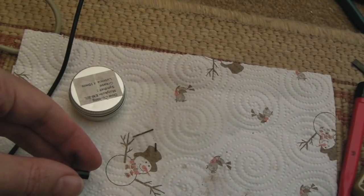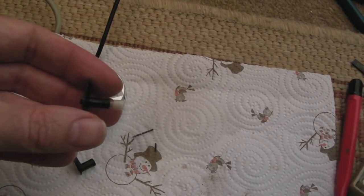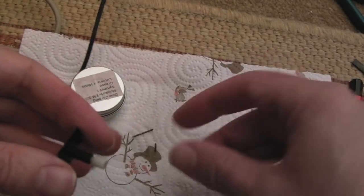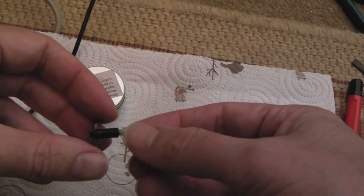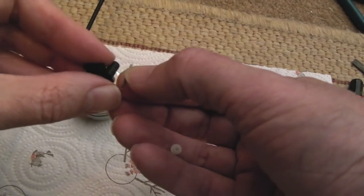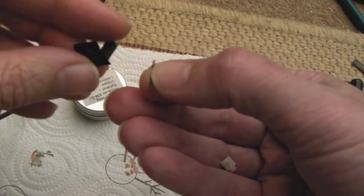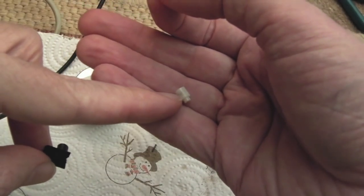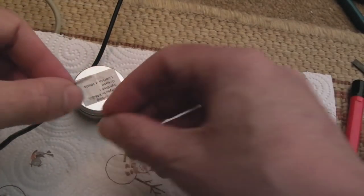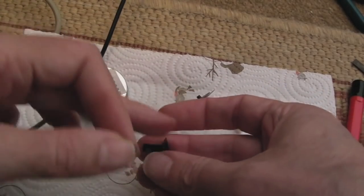I can epoxy it and show you some techniques of sticking that back together. The big problem was - see this white thing? You can pull this off. If you're really careful the white piece pulls off the end, and I did that. As it pulled off it was getting further and further up the bar, almost off, and then suddenly that bit snapped off and it's still stuck in the end here. So we've lost a bit of the bar. You may think it's game over, but if you look at the length of this we need a little bit exposed on either end - just enough to stick that on with epoxy.